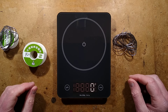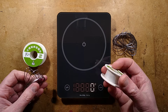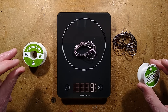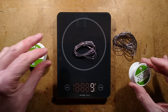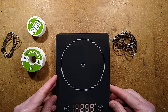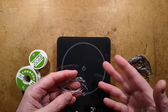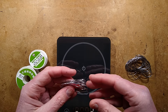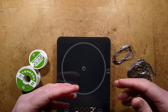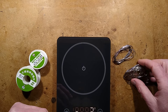How did you do with your guess? I thought it was going to be roughly 50%, but the best deal — with the 20 gram reel you at least get roughly half and half. I don't recommend using the solder. It did solder stainless steel and it flowed onto copper circuit boards, but the flux was aggressive. Some of you guessed it was acid-based flux, and I would agree. That means if you used it on a circuit board and didn't clean it off, the circuit board is probably going to corrode later on.